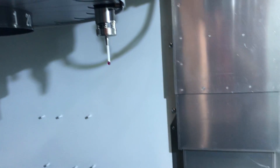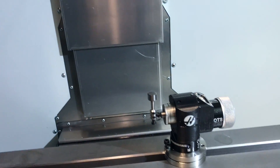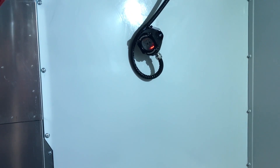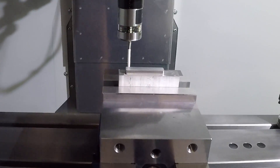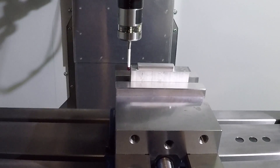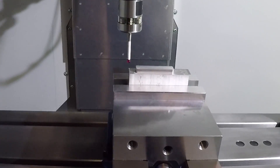The second option I added, that I'm absolutely ecstatic about, is the Renishaw probing system. I literally don't think I could live without it now that I've had it. It's so valuable, not just for setting up work offsets, but for integration with macros, in-process gauging, and it's just capable of so much. So if you're interested in any of the Haas generations of mills, I would seriously consider looking into the Renishaw probing system.